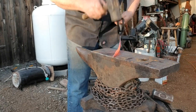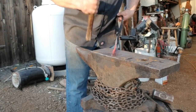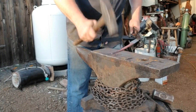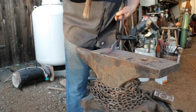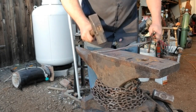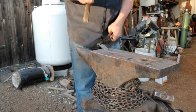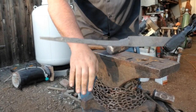This is the next day. I've gone ahead and continued drawing out the tang and made a decision — I'm going to make a blacksmith knife, also called a Viking knife. It's all one piece of tang which I'll lengthen. All I did was push the shoulder up to one side instead of in the middle. I've drawn that out using the cross peen — hammered it flat, hammered it thin — which just draws it out and makes it longer. I'm not really hammering it after dark.